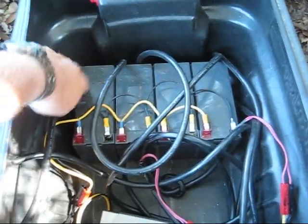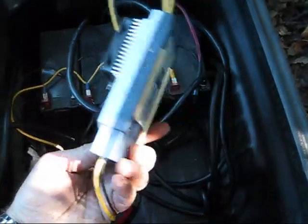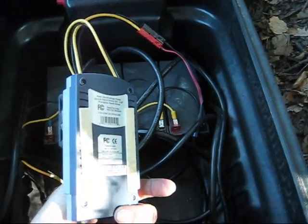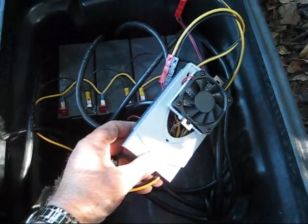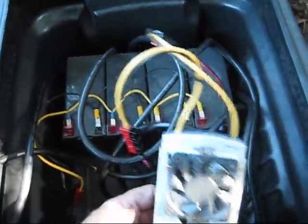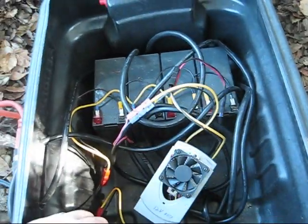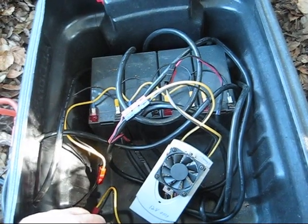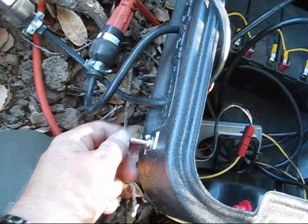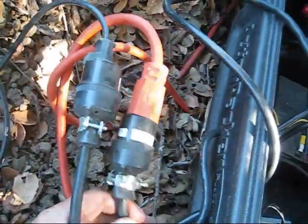Here are my lead-acid batteries — about 20 amp hours worth. That goes directly into this little controller that was homebrewed by Michael, a friend of mine. It controls the flash pattern — right now it's at four flashes and then a pause. Off to the side are two channels for the flashing, one for each string. Here's one string and here's the other string — in this case that would be the southbound side and the northbound side. I put an on/off switch in line here to make it easier for one of my parking attendants to turn the system on when it gets dark.